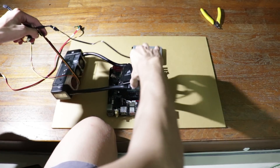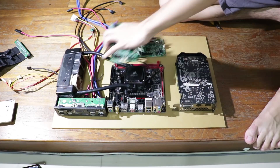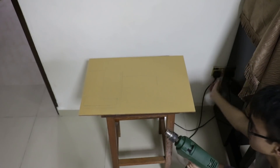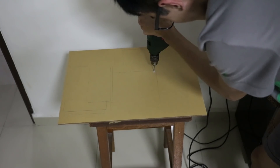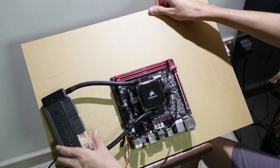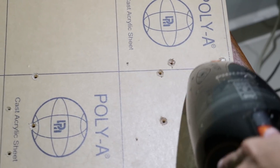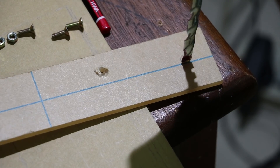I'm starting with a 5mm clear acrylic panel and laying down components, then marking out mounting holes and guidelines. Let's start drilling. The motherboard standoffs go in first, followed by testing it out with the motherboard. I'll drill more holes to mount the side panels to the base with L brackets and screws, and counter-sink the screw holes so the screw sits flush with the panel.